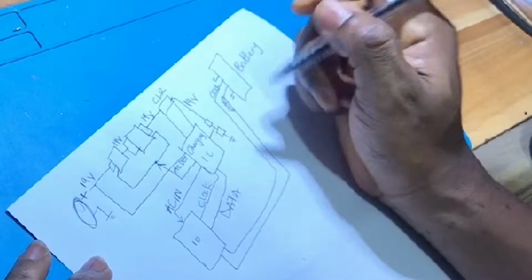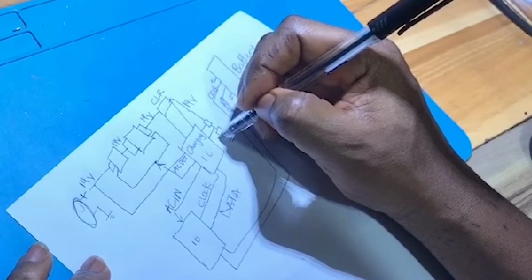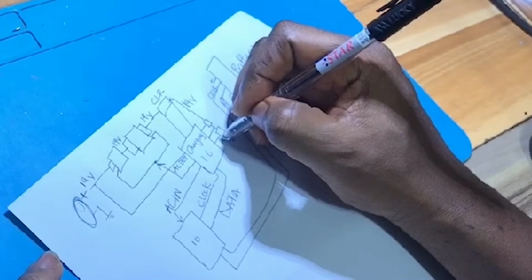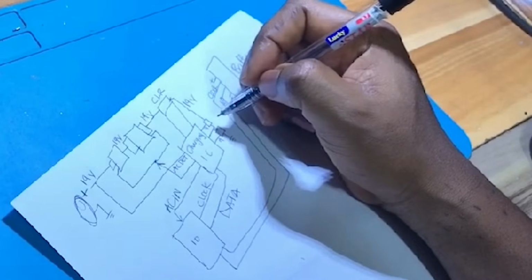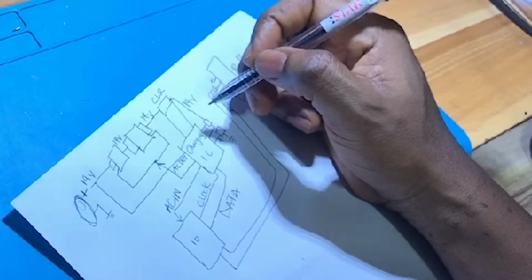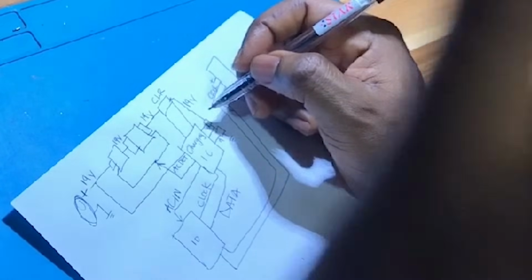And these two MOSFETs have their gates controlled by this charging IC. So these two MOSFETs, to me, basically form a voltage divider. And why they didn't use a normal voltage divider is because this thing is working on various voltages. It's not a static voltage, because it depends on the battery voltage. This has to switch to match the right voltage just to keep the battery charging.